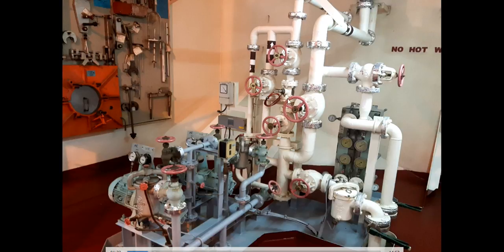as we used before. Here we have viscosity indication. This is the only place where we have an indication of viscosity. And be sure that all return valves and all suction valves from the tank until the end are all open and properly set up.